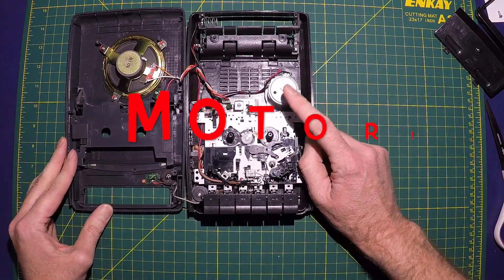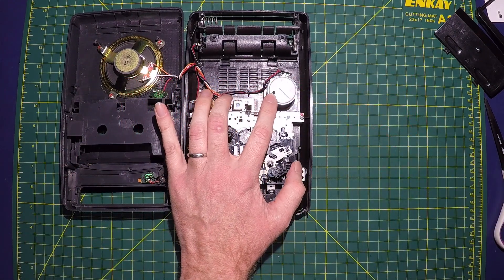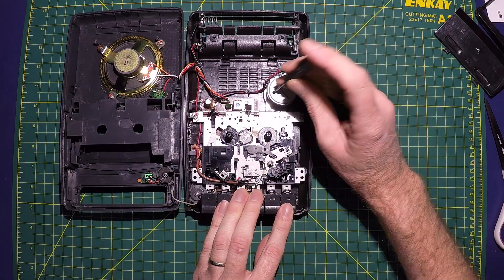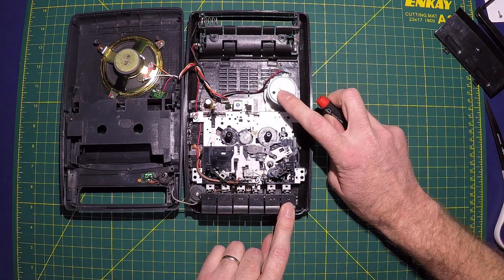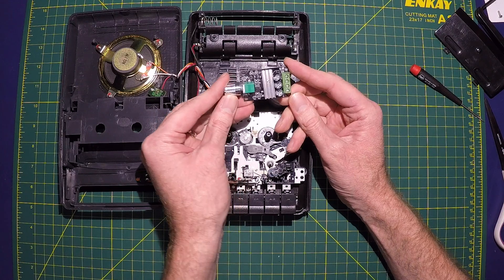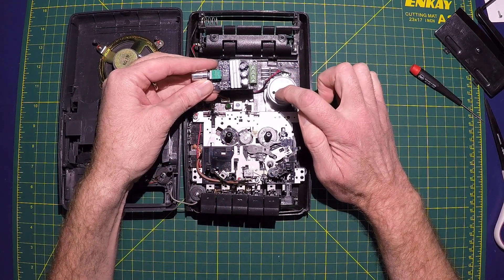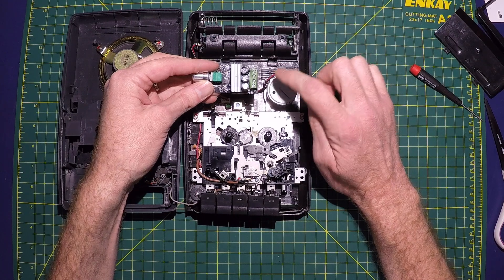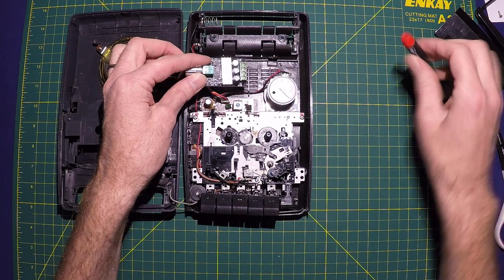So the battery right here, and that little hole is actually an adjustment. There's actually a little trim pot you can reach through with a small screwdriver and turn to adjust motor speed. But with this Pulse Width Modulation circuit, we can bypass that internal trimmer and wire our power directly to the motor underneath this cap and get a much higher range — much lower and much faster than we'd be able to get by just adjusting this.